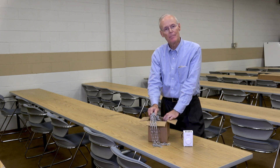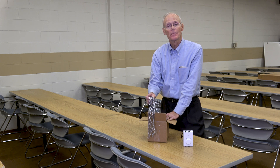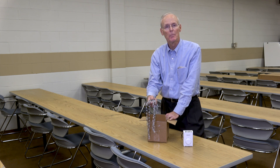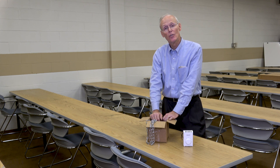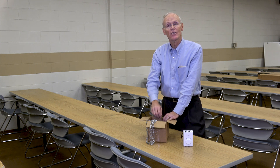The last little bit in the reflector package is the chain. If you order a 40-foot reflector package, you'll get enough chain to hang the 40 feet at 3 feet below the ceiling. If you do need some more — if it goes a little bit below 3 feet — you can just buy this at any hardware store, Home Depot or whatever. And don't forget the thermostat. This is a Honeywell thermostat. Any single-stage heating-only thermostat will work just fine. This is a line voltage, or you can get a 24-volt too.